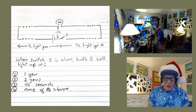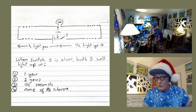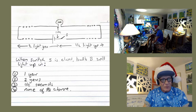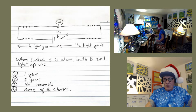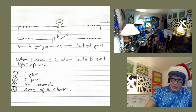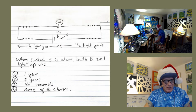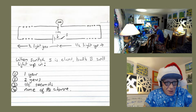Alternating current can very easily be sent through just one single wire, and it's not done except in special cases, because there are some downsides. When streetcar trolleys first started happening, they used a single wire until they discovered that the sewer lines were falling apart through electrolysis happening in the location of the lines. So that's real quick if you understood what that was about.